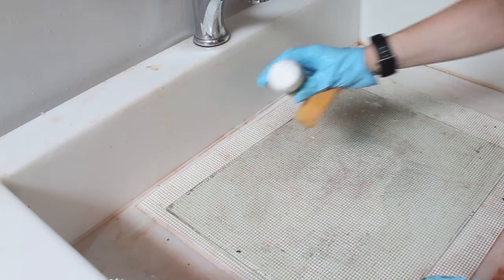Once the silver has deposited with a nice brilliant shine, rinse off the excess silver on the surface. Then tilt your mirror and allow it to dry completely before painting. Here you can see I'm painting the back of the mirror — you want to get a nice even application. I'm using the mirror backing paint that comes in the mini silver kit, and I like to use a foam roller as I find that gives the best finish. Once the backing paint is applied to the full back of the mirror, allow it to dry completely overnight.